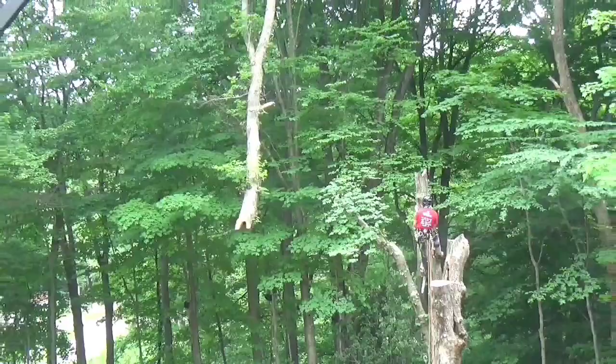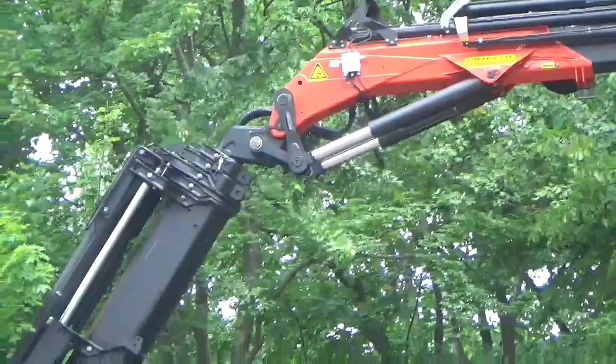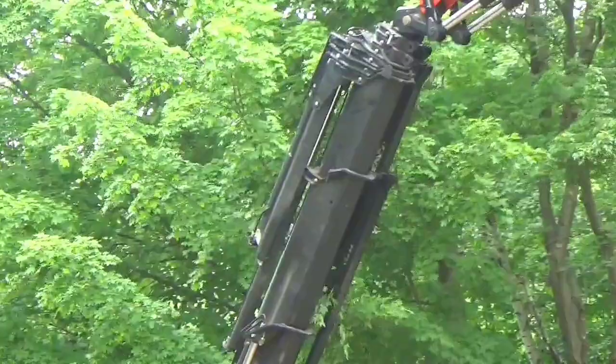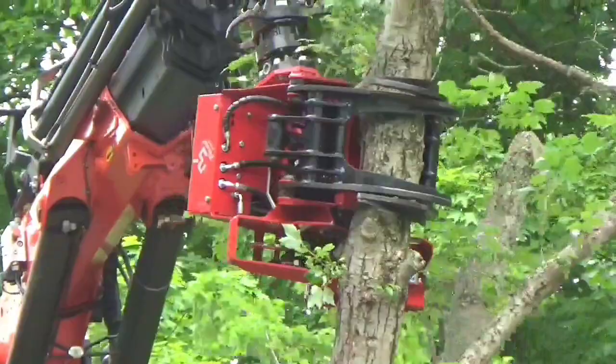That's a very important thing: when you're cutting, be in good cut position where you can put your eyes in the kerf and see exactly how the wood is reacting and what the saw's doing — so you're already lined up. The last thing you want to be doing is cutting in a bad position. You want to be right over the saw in good position. I always say 'chest height, best height' — because you've got control with two hands, you can look up, look down, put the chain brake on, come around, and feel around. If you're in a bad position up high trying to pull the saw out and feel the front of the kerf, you're not going to be able to do it.